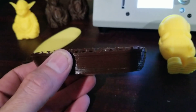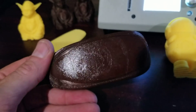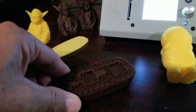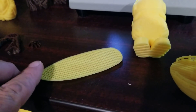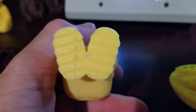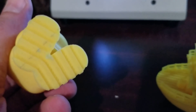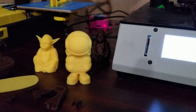This print here is a long print that eats up about 80% of the length of the bed. The problem with this one — you can see it — it curled up off the build surface. So this boat is a rocking boat. This was an early failure; it came off because it curled. With the stock build surface, I printed this little filament astronaut and it came out pretty nice, but I printed it on tape — green tape, not blue tape — over the stock build surface because I couldn't get his little boot grips to adhere. They were coming right off the build surface.